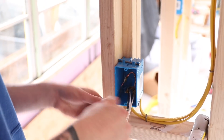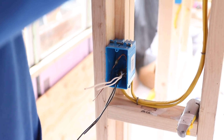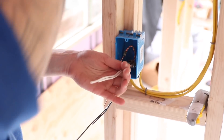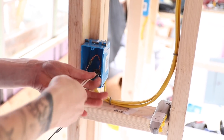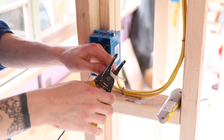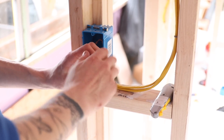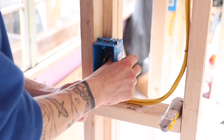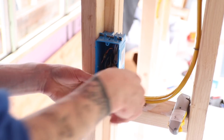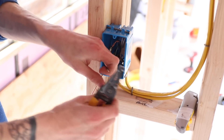Push the ground into the back — that's your ground ready to hook up. Switches don't need neutrals. The neutral is your white wire, coming in from your incoming power from that plug, and going out to the light through the switch. The switch is just designed to break power, so the neutral isn't needed. I like to spin my neutrals together, keep them tight, cut them to equal lengths, strip them, cap them together so they feed past the switch, and tuck them up into the box so they don't get in the way.